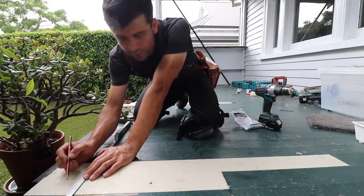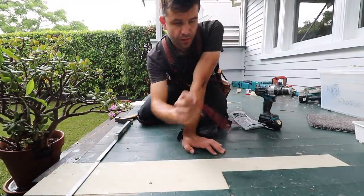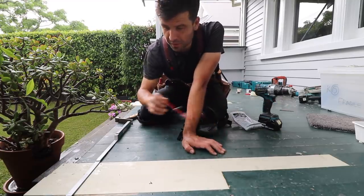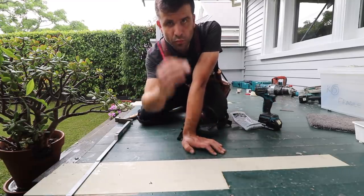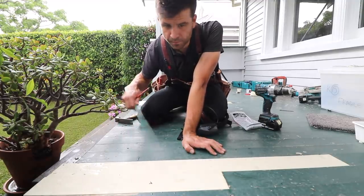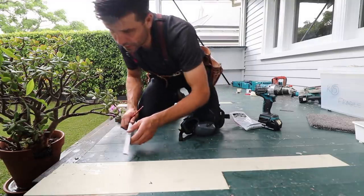I think it's always good to stagger your joints as well. So I join them at this joist and that one, instead of joining them at the same joist — because things do move and you do see a line. You're not seeing an obvious repair where a post was. That's the way I figure it anyway.